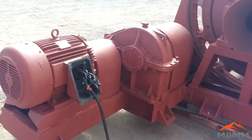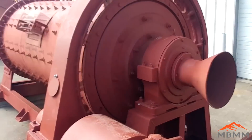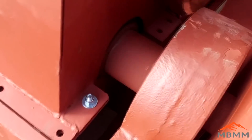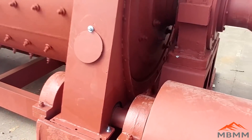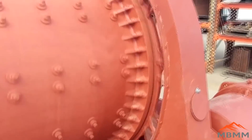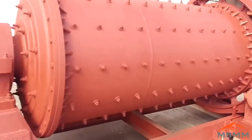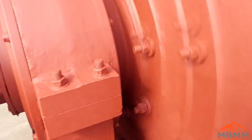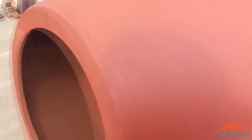This is the drive mechanism for the ball mill, and this unit is run by a 40-horse, three-phase electric motor. The gearbox reduces the output of the motor to the correct spin for the ball mill, and we're looking at the jack shaft here that runs the bull gear which turns the ball mill. The studs on the side of the drum hold in the liners that are cast manganese for reduced wear on the drum. The ball mill is supported on each side by two large spherical roller bearings, and the shaft that goes through the roller bearings is hollow to allow input and discharge from the mill.